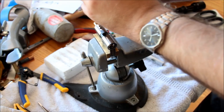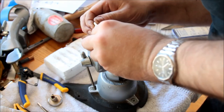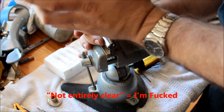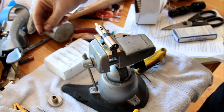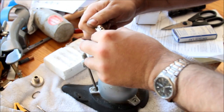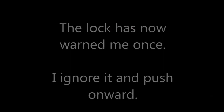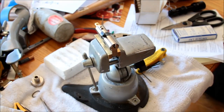I just removed a little set screw and the handle. It's not entirely clear how this comes out, but I suspect when I remove the circlip I'll find out - so I've got my trusty circlip pliers. There - circlip done. I was hoping this might disassemble easily; there seems to be a pin in there but it's not immediately obvious how to get it out. I'm going to have to do this the right way, which means I need a lot more tools.